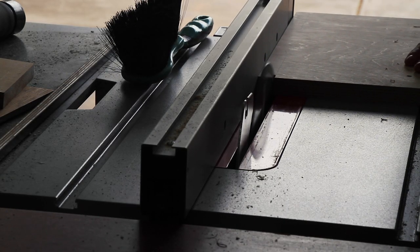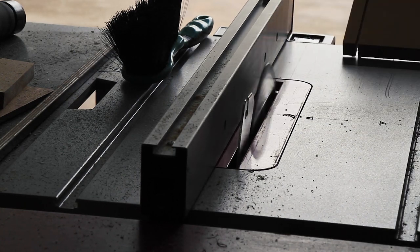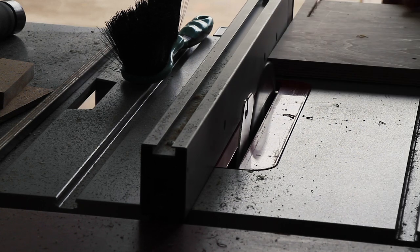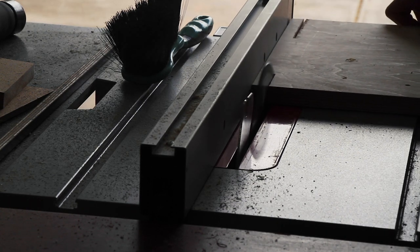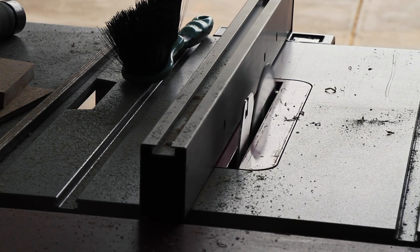This piece that I'm cutting here is for the center of the shelving that sits vertically. These pieces I'm cutting out to sit the stretchers in. I'll finish this off in the vise with a dovetail saw.